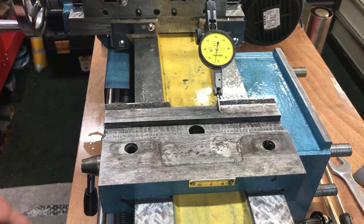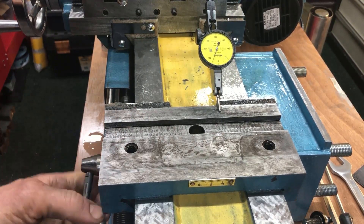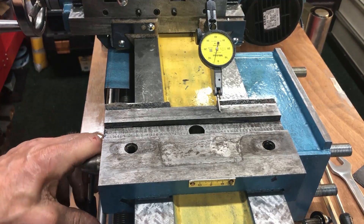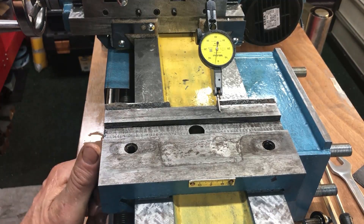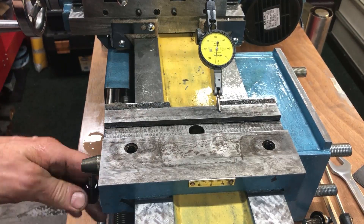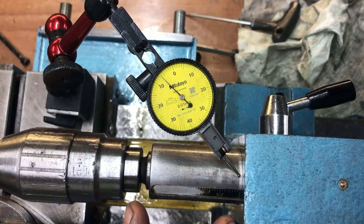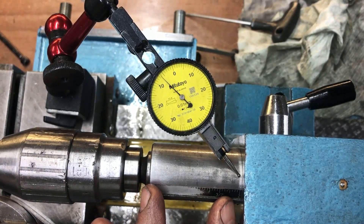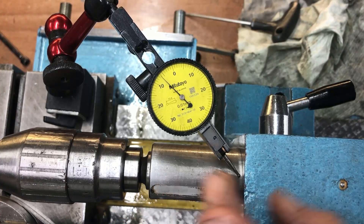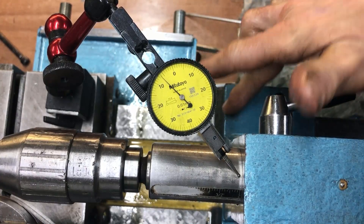It's higher, and if you loosen here, you can see it rises higher there. The real test will be to measure the spindle, of course. Testing the travel that was initially planned by the manufacturer tells me that this tailstock sits a little bit high at the front here.